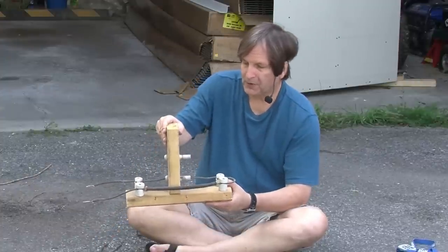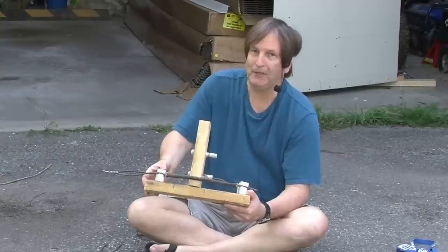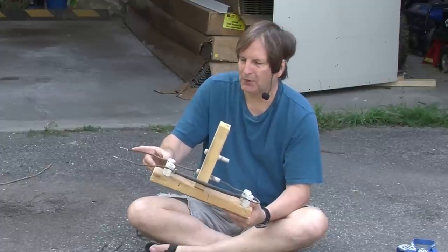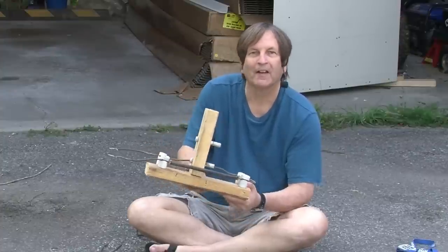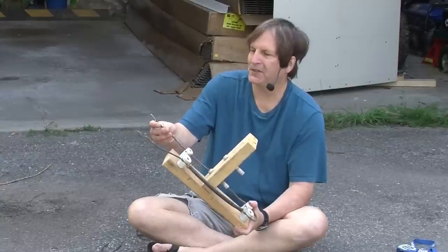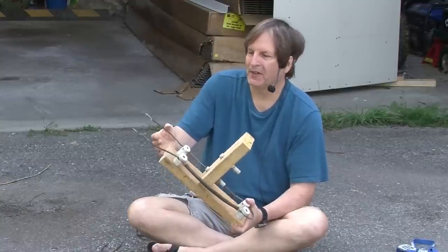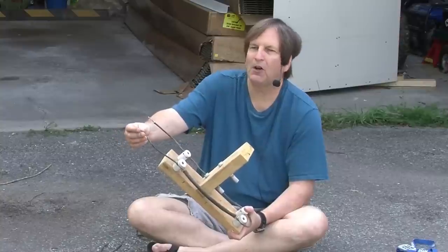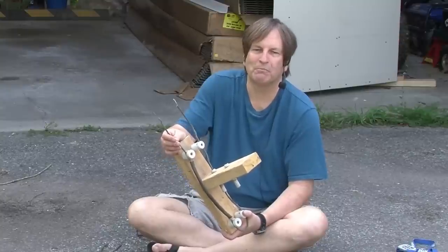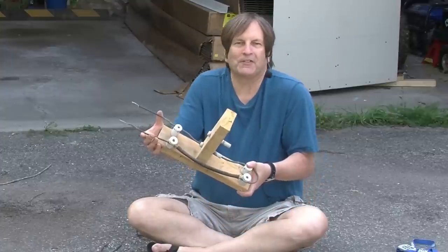What we're going to do is test this by passing ever-increasing currents through the wire and basically see how much current it can handle before the insulation starts to melt, boil, or burn, or perhaps the insulators get so hot they actually crack. Because this is 100-year-old wire, we really don't know how the insulation has survived the time — it may have gotten worse, or maybe it dried out and got better. There was also certainly a lot less standardization back then, so different knob and tube installations may use different wire and behave differently.